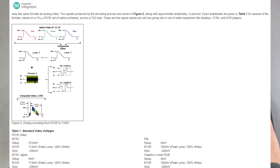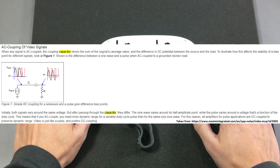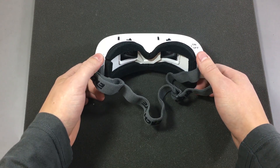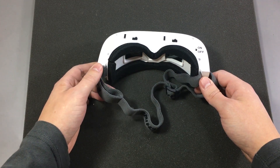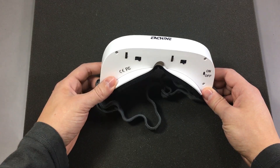In analog video signals, the voltage levels matter a lot because different voltage levels indicate a new line or a new frame. Having these voltage levels out of their specified ranges will create various distortions on screen. To solve this, a capacitor is used to AC-couple the video signal. This way the capacitor removes any DC voltage present on the signal, leaving just the AC signal with the correct voltage levels and no distortion. In this case they used a ceramic capacitor, but it's a small value — around 20uF as reported by fishpepper. For good decoupling, a higher value of at least 100uF should be used, and a Maxim datasheet shows 220uF. But such a capacitor is more expensive, so the manufacturers probably decided 20uF would work fine.